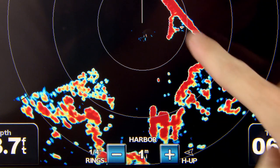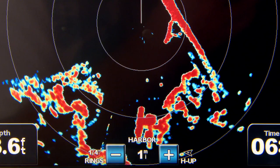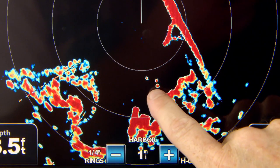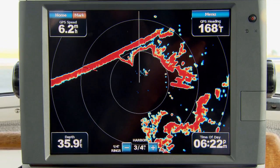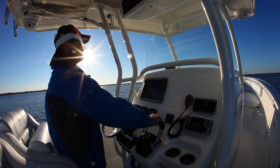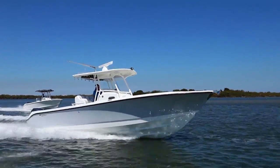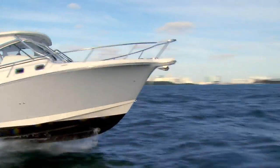All of these red marks on the screen are radar targets. There's really no way, except through experience, to determine what each target is — a big radar return could be a line of thunderstorms or the coastline, and small targets could be boats or buoys. But the good news is, thanks to your radar, you know something is out there, and if it's big enough to show up as a return, it's big enough to cause damage to your boat — so stay clear. Turn your radar on every time you're out on the water to build familiarity with what objects look like on screen.